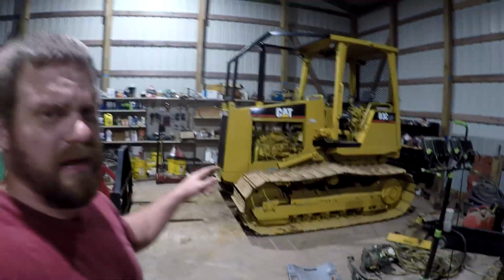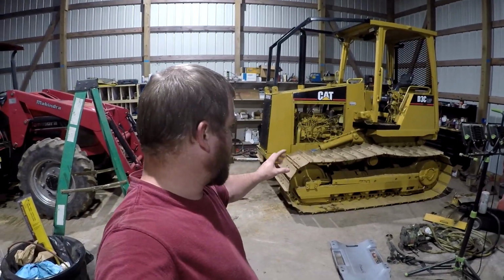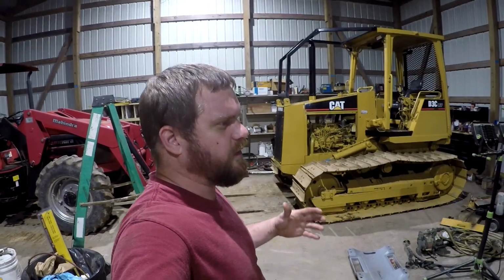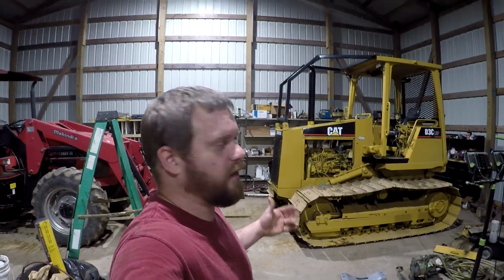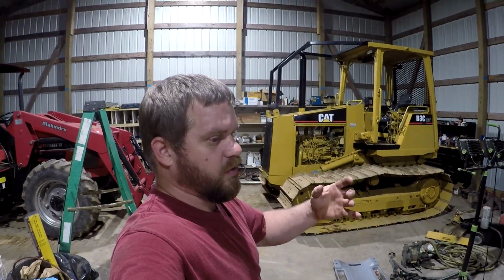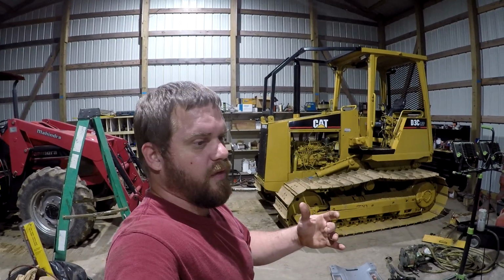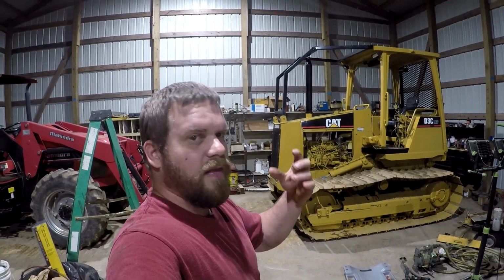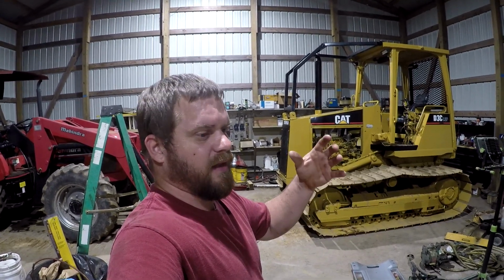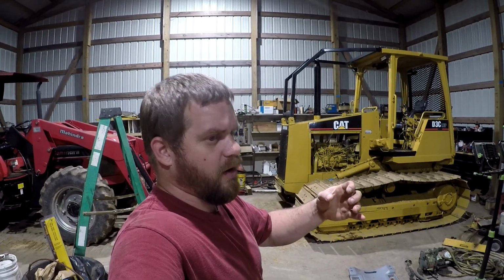I've got the bearings that I ordered for the blade mount down there. I've had them in the freezer for, I don't know, like a week since I got them in. Put the box and all in the freezer, that way they would get cold and shrink because they're press fit into the mount. I've got the eye bolt mounts in the oven set at 350 degrees, so hopefully they will swell up a little bit and the bearing will shrink down a little bit being cold.